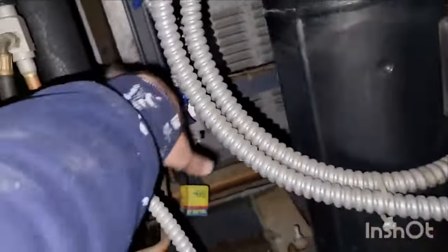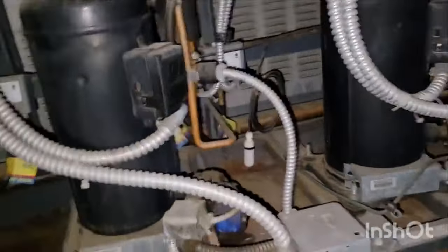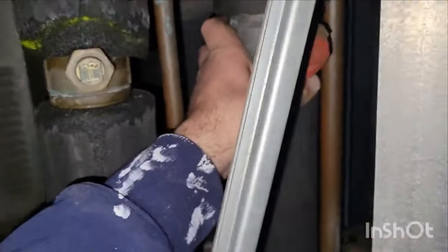I've had friends of mine take compressors and isolate compressor after compressor after compressor because they feel, oh, this is hot. This is hot. This is hot. And they go, there must be a compressor blowing by. Before you do that, check all the suctions and try to see, is there a hot gas valve blowing by? And you want to check every single suction, okay? Every single suction, all right?